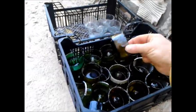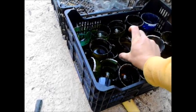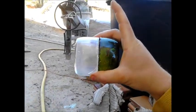After cutting the bottles, I had a big pile of cut glass bottles and bottle brick parts left over. You have to make sure to have the right amount of cut bottles of each of the colors you wanted. You also have to make sure to cut the glass bottles to the exact length that you want so two of them add up to the wall thickness that you want your glass bottle wall to be.